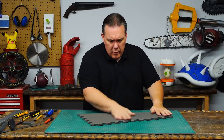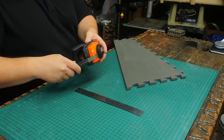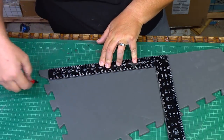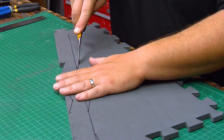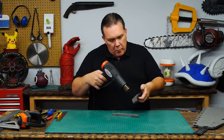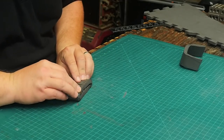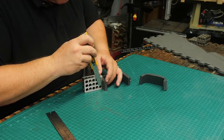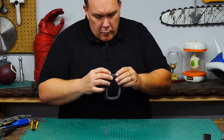I know I'm going to make this out of foam, so I base the size off of a pair of ear protectors and just cut out a couple of strips to fold into the basic shape. I'll start with 3½ inches for the long side, then add 2-inch legs that'll have half an inch rise. These strips are an inch and a half thick, and I heat up the foam with a heat gun so I can fold in the sides and start to make a box. I use some 1-2-3 blocks to cut the legs square so that they'll glue together correctly and be about 2 inches wide when finished.